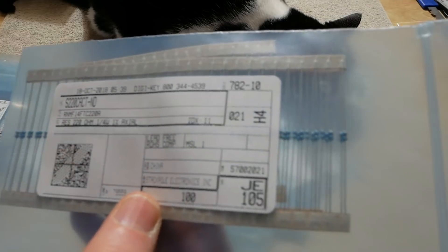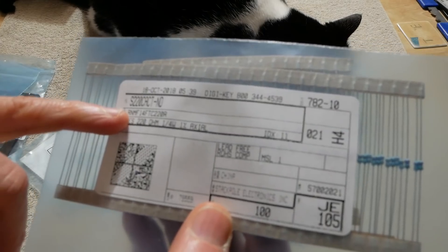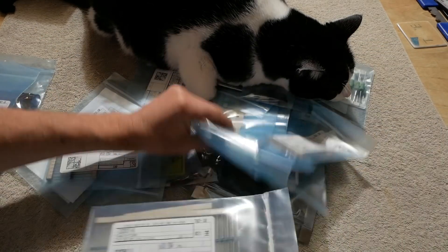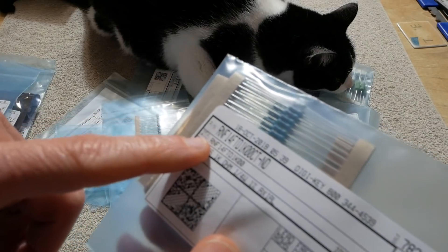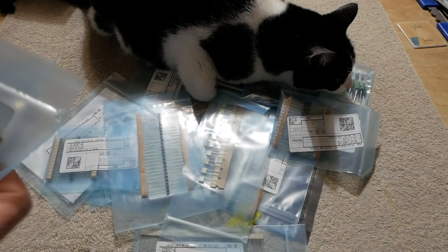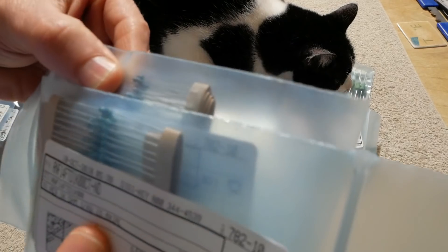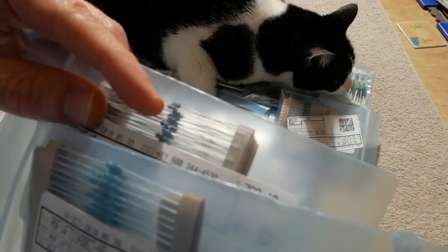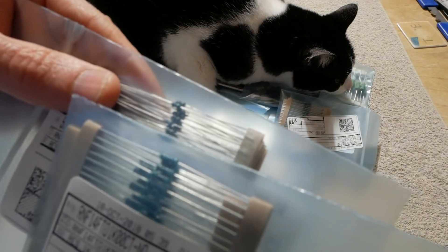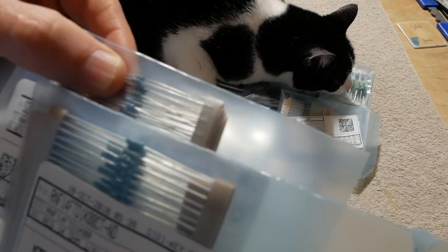What happened is I got the wrong ones — they're the RNMFs. Somewhere there's the regular size: the regular quarter-watt ones are just RNF. So I made a boo-boo ordering these. I'm going to keep them — you can always use metal film resistors; they can take some extra heat. But they're asking this small form factor to dissipate a quarter watt max rather than the normal eighth-watt size.